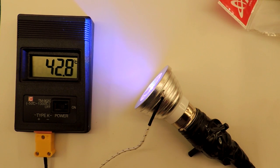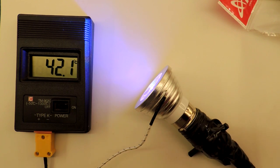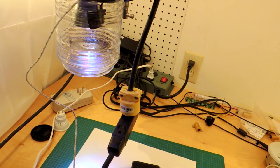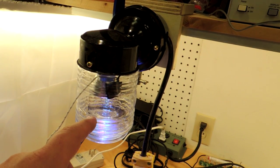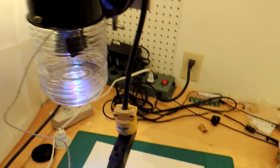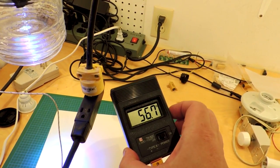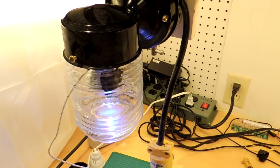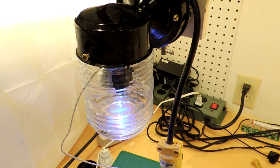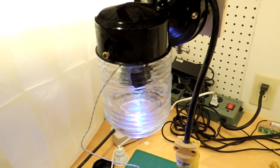One other item of note is just the body temperature. Using a thermometer with a K-type thermocouple and just resting it gently on top of the surface of the bulb, it gets reasonably hot at 40 degrees centigrade. In an enclosed light fixture, like a housing, the bulb obviously doesn't draw a lot of power — it's a very small bulb — but even a bulb like this will start to see fairly significant temperature rises. It's now about 60 degrees centigrade. That's of course the biggest problem with enclosed fixtures. I didn't think a bulb of such modest wattage would see such a significant increase.